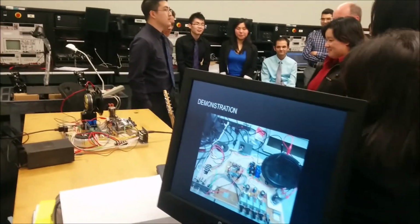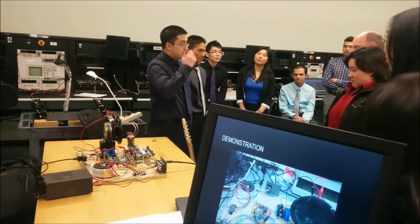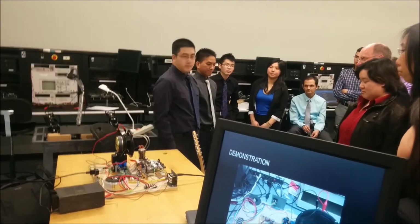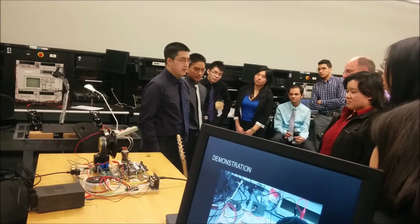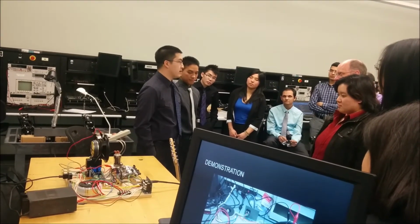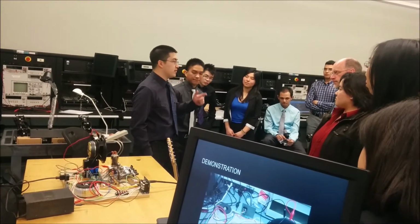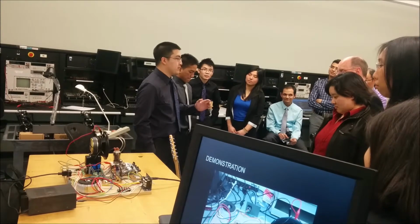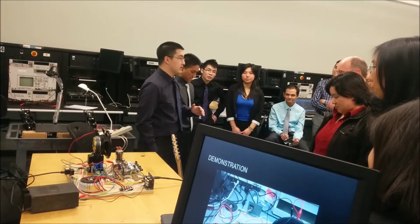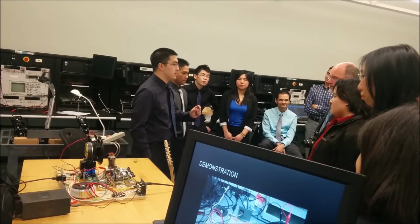When you use a pentode, I know the pentode's got 2 extra screens in between. What's the advantage? There's no advantage aside from the fact that you can't actually find triodes in that power range. It's been found that back in the day when they first invented these, the triode had too much Miller capacitance between the electrodes. So it would limit your gain at high frequencies, and there was no point in making triodes that large but have so little gain.